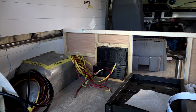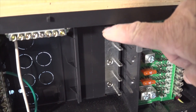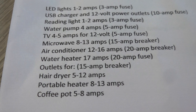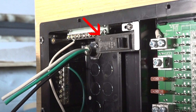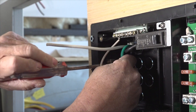Caution: prior to doing any wiring, make sure no power source is turned on and remove all jewelry. The DC fuse board has spaces for 11 DC fuses and there are a total of 10 AC breaker slots if you use duplex breakers. You need to know the load on every circuit so you know what size fuse or breaker to use. I made a list of what we are using in the van with load requirements so I know how to size the fuses and breakers. We have our power inlet and cable installed, so we can start the wiring by connecting the power cord to the inverter and then go out to the 30 amp breaker in the power center. Then connect the black hot wire to the breaker, the white neutral wire to the neutral terminal, and the green ground wire to the ground terminal bar.